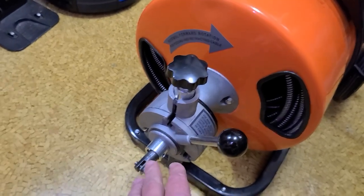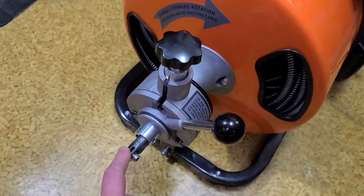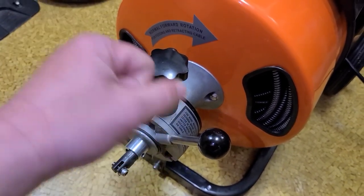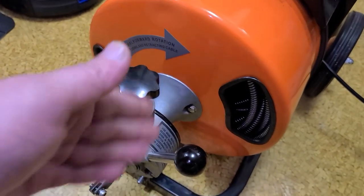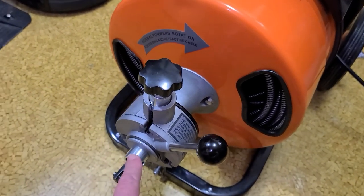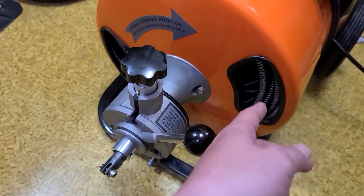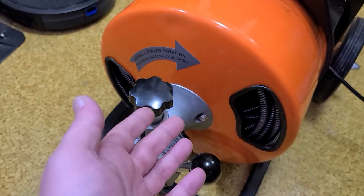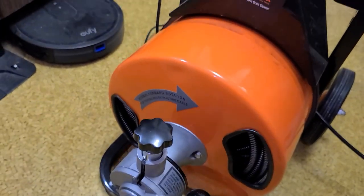The reason those can become troublesome is when you have a real tough clog — as the cable is feeding out and hits that clog, if you're just holding the cable by hand, it will start to bend and loop out, and you can easily feel that it's binding. You quickly reverse it and then go back and forth repeatedly hitting the clog. With those spiral elephant's trunks, what ends up happening is the cable starts binding and twisting up inside the drum, and a lot more tension builds up. It's not as easy to feel when the cable is actually hitting a clog.